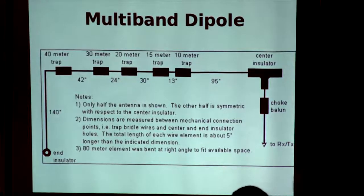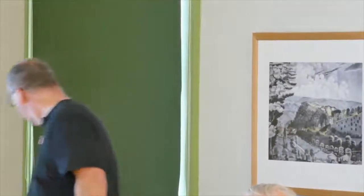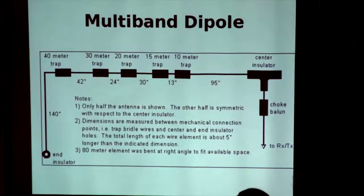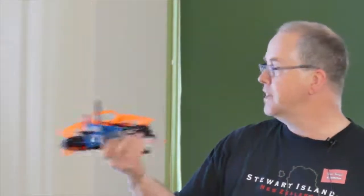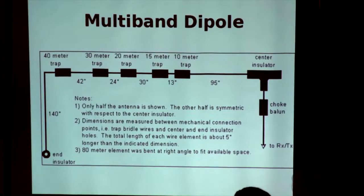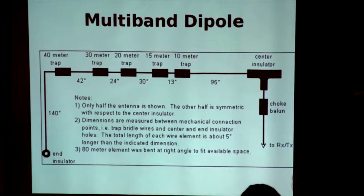Has anyone ever used a multi-band dipole before? I decided to see how light I could make these things. That is the entire antenna I've taken on DX trips. Each individual band — instead of involving a trap in the calculations of how long and how big the separations have to be, I just put an Anderson power pole. So if I want to operate on 15 metres, I literally just connect all the sections together. From a QRP perspective you can make that on site, and I did, and it works.